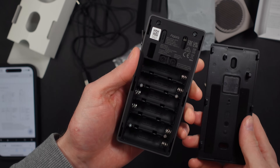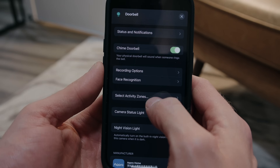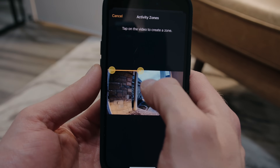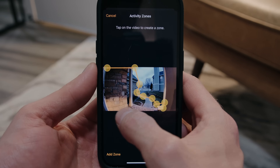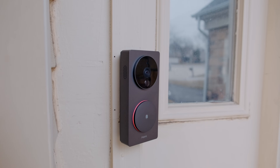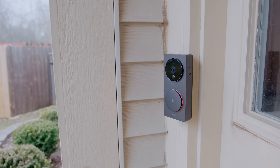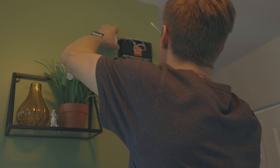You could hire someone to wire the doorbell and then add it to your smart home. The doorbell requires 12 to 24 volt AC or 8 to 24 volt DC power if you're wiring it. For battery power, Aqara rates the six AA batteries to last three to four months with 30 detections per day. You can tweak activity zones to leave out busy roads in front of your home, and signal strength to the chime box might also affect battery life. Personally, I find the AA battery choice very odd — I would much rather have a well-insulated lithium-ion battery inside the doorbell.